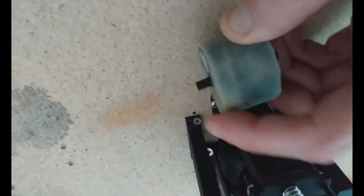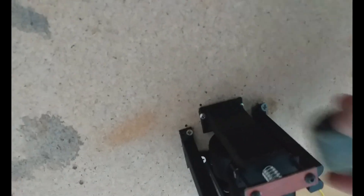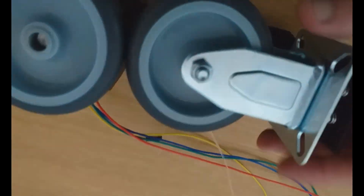The next thing we did was try to cast an elastomer coating around the puller wheels - make like a polyurethane elastomer cast over the 3D printed part. We actually 3D printed the mold and cast the elastomer. Unfortunately this failed a little bit - it is more rubbery, but still a bit thin. I decided to throw it away. The main reason is the motor was quite small - a NEMA 17 - and it didn't have a lot of torque. So I switched out to a bigger motor, a NEMA 23, and bought some rubber wheels with spring tensioners. It works fairly well.